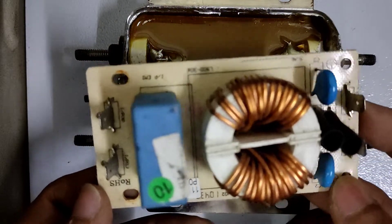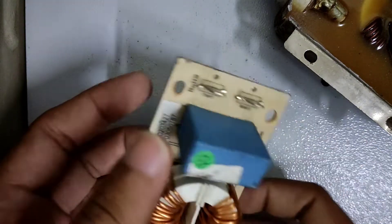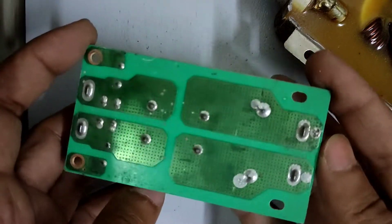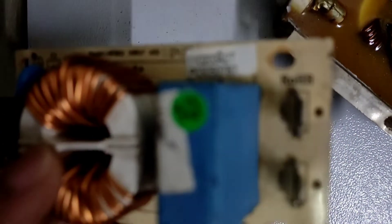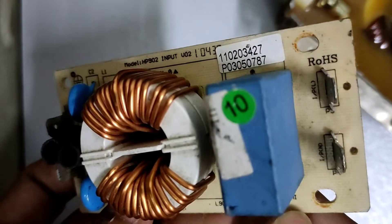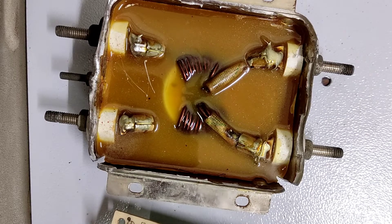This can be a very close approximation of what's inside of it. In this one you can see a couple of capacitors and MOVs, a choke of course, and here it's marked line, phase, neutral. This is also a single phase unit — you can see where the earth goes, and everything is in series. So let's assume this is going to be the same circuit that's inside the industrial grade unit as well. You can see it's marked input and output, with a couple of MOVs and other things which could be present but well hidden inside the potting compound.